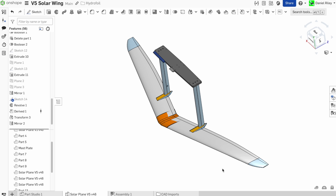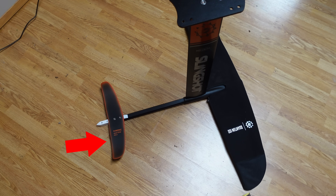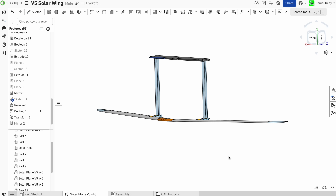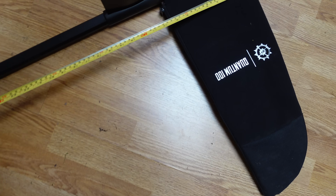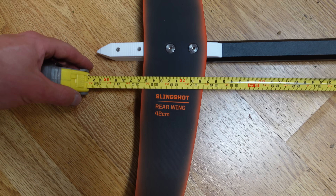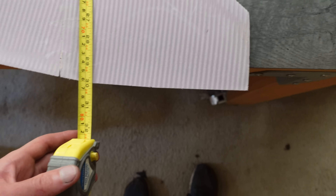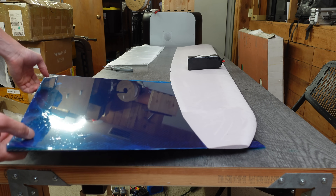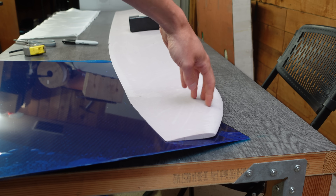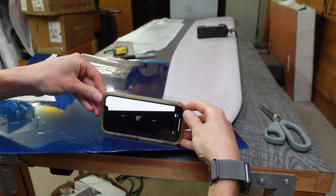One of the big unknowns was whether this thing would be stable enough on the pitch axis for me to ride. After all, the vast majority of hydrofoils out there have horizontal stabilizers, and this one doesn't since it's a flying wing. But what it does have is sweep — the amount that the wing is angled backwards. It turns out the distance from the wing to the horizontal stabilizer on my off-the-shelf hydrofoil is the same as the sweep on the big wing. So in theory, if this wing ends up having the right amount of twist, it should give enough pitch stability for a human to ride on it. I'm going to try to control the twist by using a flat sheet of carbon fiber as a wedge to lift up the trailing edge while the epoxy cures. I also decided to give the wing a lot more twist than the original solar plane design — though this is totally just a hunch.